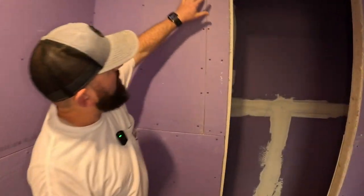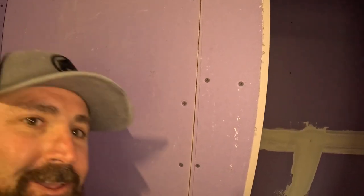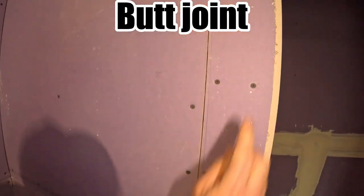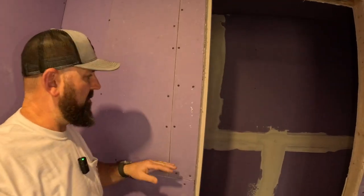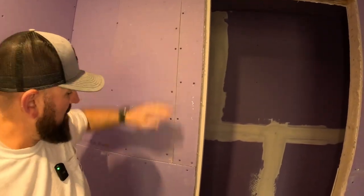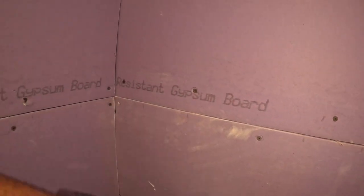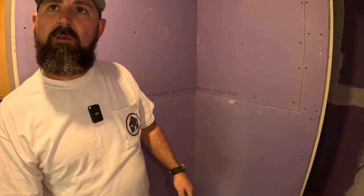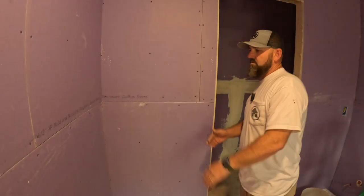You've got different kinds of patches. This right here is a butt joint — you want to put more drywall screws in it because it's butting on the stud and you don't want it to crack. These tend to crack if you don't put enough screws in. This here is called a bed joint — it's inverted a little bit, so it gets a nice bed of mud. Then you've got your inside corners and we've got one outside corner here.